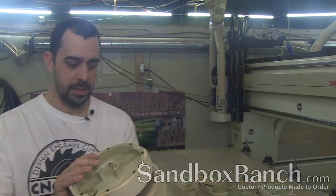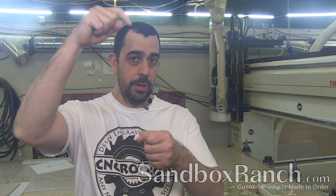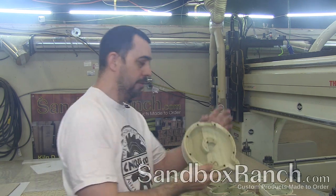And I've also optimized this one a little bit further regarding screw placement. That's another issue we saw with the earlier banks, is sometimes the little screws will come out. And the reason for that is pretty straightforward. Wood expands and contracts. So for this production run and onwards, I actually use a smaller bit. And what that does, in production you probably never even would notice. But what it means is there's less material removed when I do the drilling operation. And because of that, there's more holding on to that screw, because the last thing you want to do is give this to a kid and have all the screws fall out.